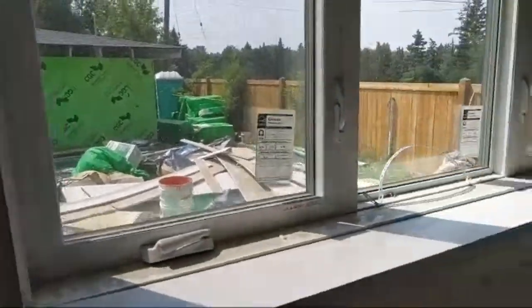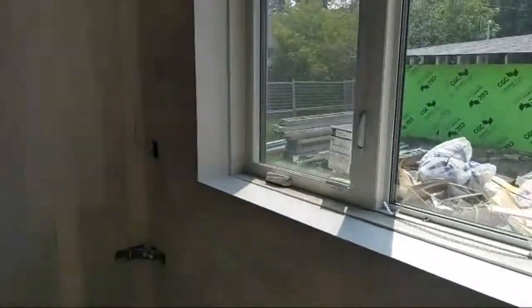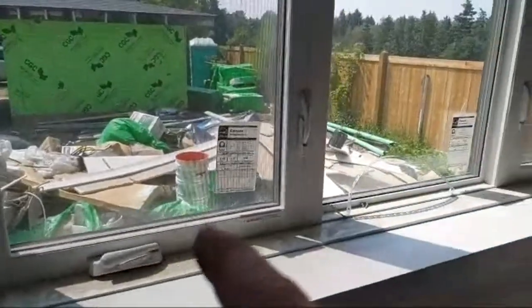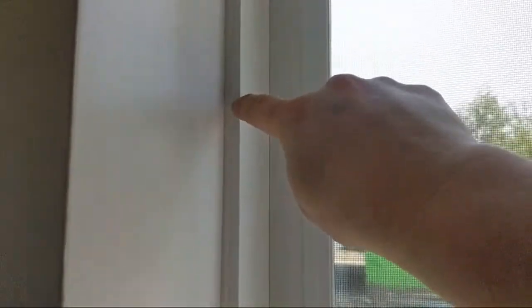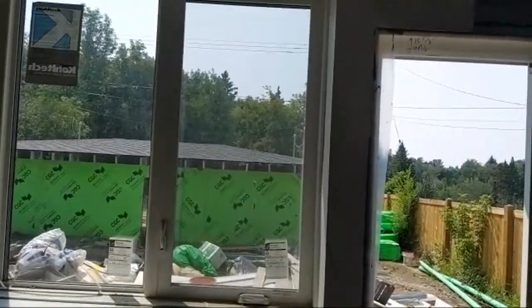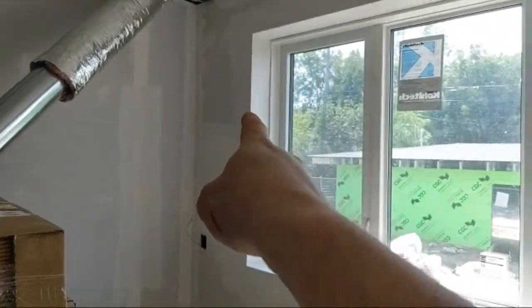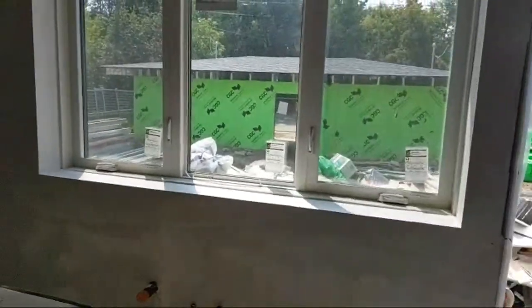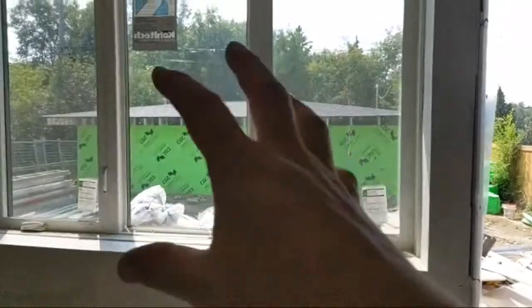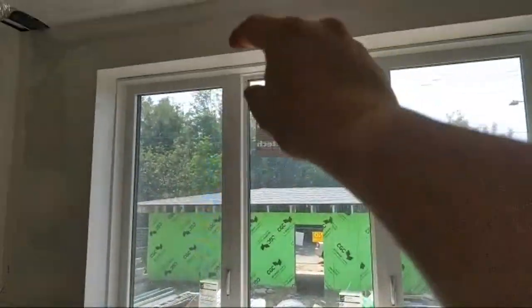And then corner bead, just this is like a normally taped window return or whatever. Sorry guys, the light. So the problem with this is I like to maintain equal distance around here, and I tried, but it didn't turn out so good. That's why, guys, the framing was despicable. I had to put a piece of 1/2 inch on that side, a piece of 1/2 inch on the bottom, just to get it somewhere in the area, and then this side here, it just wasn't perfect.